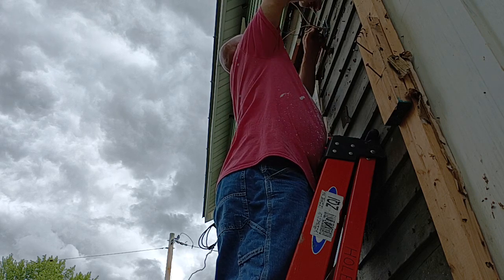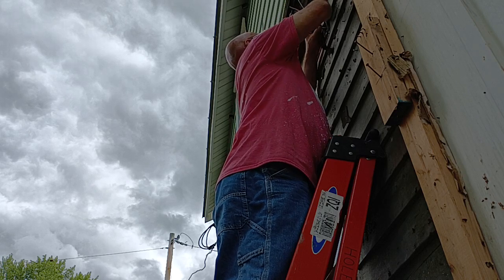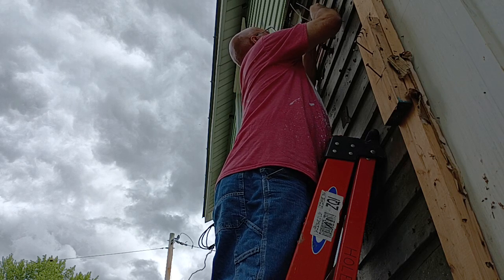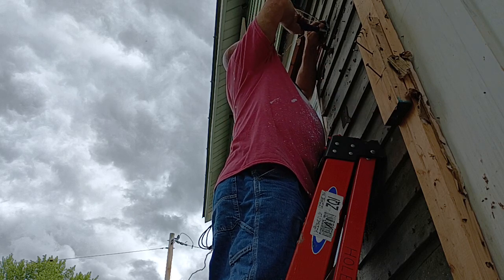Okay, so I will get our wires back down into our box, and our jacket coming in only about a half an inch into the box, because you don't want the jacket coming in too far, and we'll tighten our screws up here.